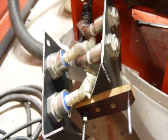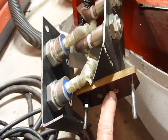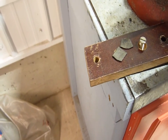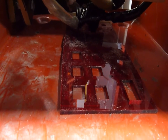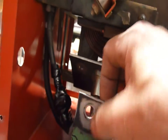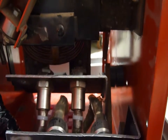There's a phenolic here, and that's how far they're recessed normally. This is fine for this one because it's well away from the chassis. But the first one I've drilled slightly deeper here, and then I'll glue these rubber pieces over top just to make sure there's no arcing — a little bit of unwanted arc can ruin your whole day. Down in there we have a lug nut that comes from the diode pack. I'm going to put in this piece of plastic from an old piece of equipment I stripped, as an insulator, just to make sure the lug does not short out to the case. I've drilled out both holes needed for the output wires. I've sanded them down with emery cloth on both sides to make them conductive and get rid of the paint. I'll re-attach everything and make sure nothing can short out.